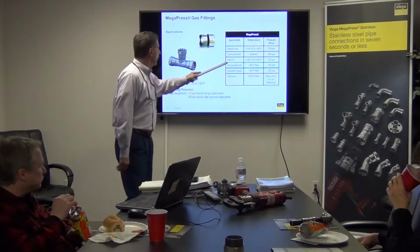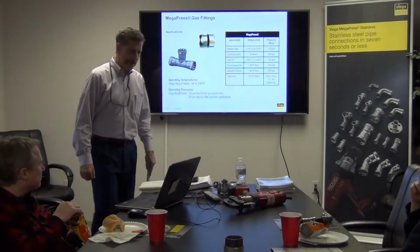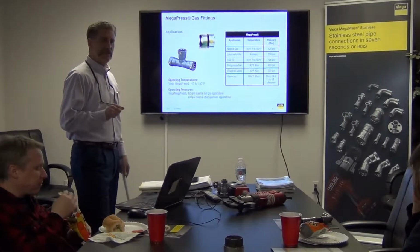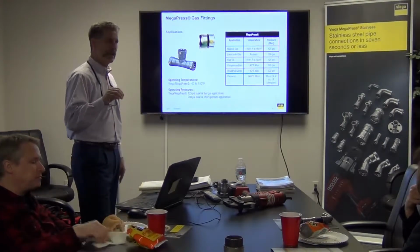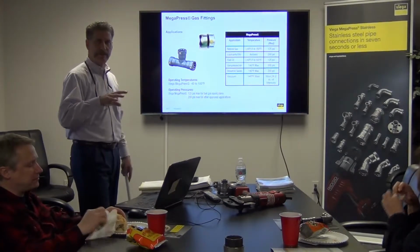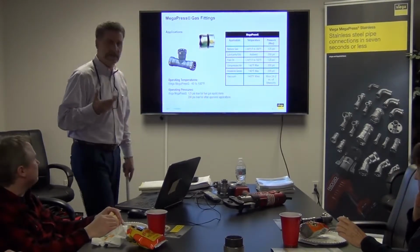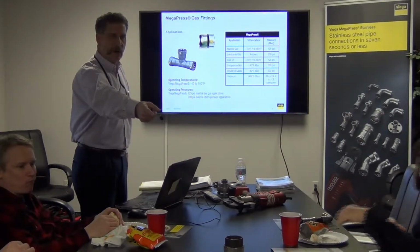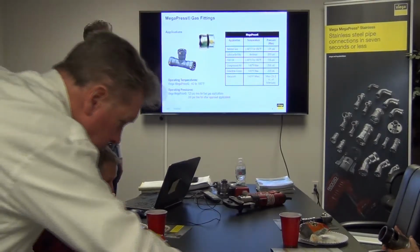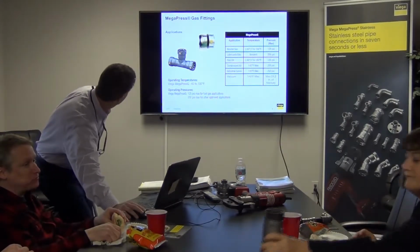And remember I said earlier that the compressed air, vacuum line, etc., that's when you have those kind of things, because it has oil in it. And the HNBR sealing element has engineered properties to resist what hydrocarbons would normally do to rubber. It would attack it and kind of break it down. So just like the EPDM, it's got resistance to chloride, for chlorine and things. And we'll show you when it's pressed in the cutaways that those sealing elements are totally encapsulated in the metal. So it's not like ozone will attack it, sunlight doesn't attack it. It is completely encapsulated in that metal, so it's locked in for life.